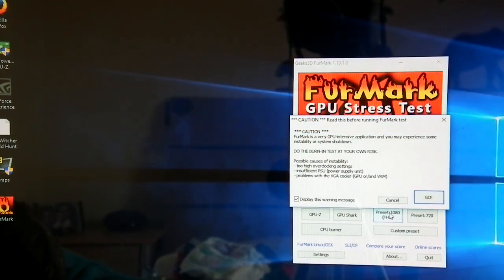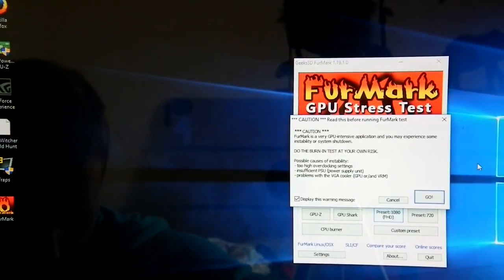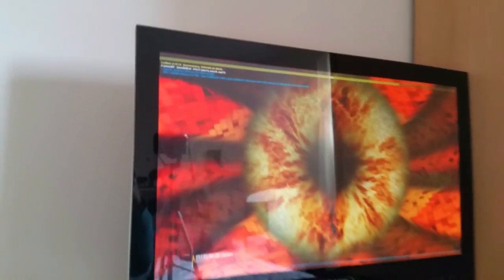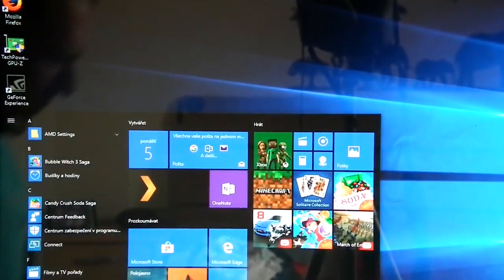I'll be recording the card to see if anything happens on the monitor. Okay, go. As we can see, the card is actually working but doesn't have enough power — the score is only 570/74, which is not correct, and we're only getting 15-16 fps on full HD in this test. But I think the card can survive if I solder back some of the components. We'll see. Okay, I'll switch off this PC and try soldering back the components.